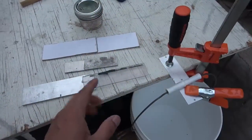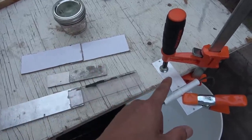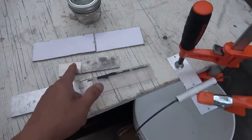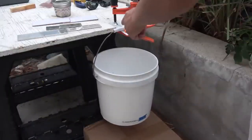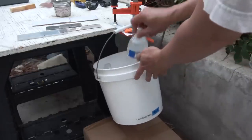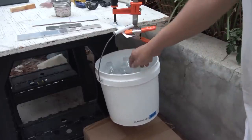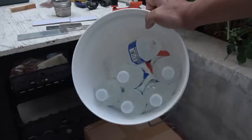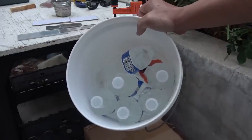So next tests are for different materials that I glued this morning with the acetone glue. Aluminum to aluminum, plexiglass to aluminum, steel to steel, and laminated wood. Alright, first up, aluminum to aluminum. Well, it finally fell off, and that's with 6 half-liter water bottles or 3 kilograms.